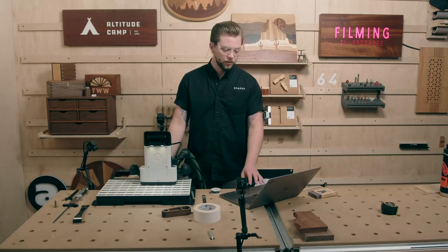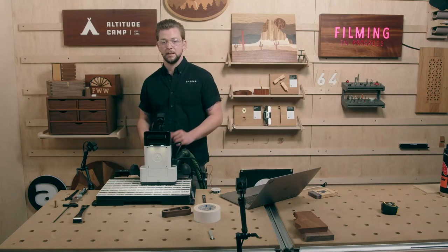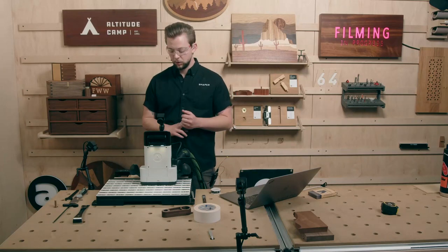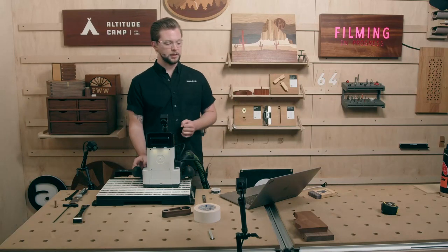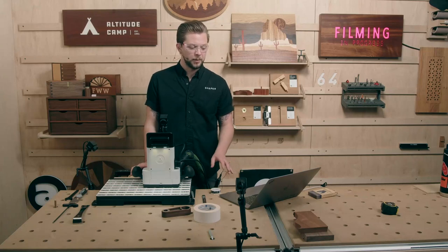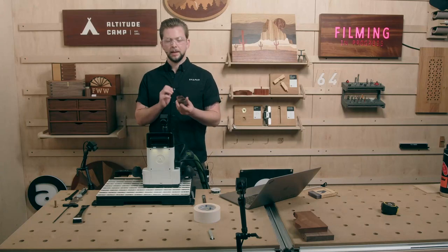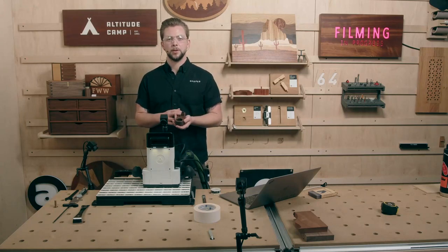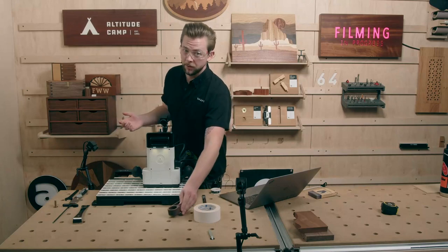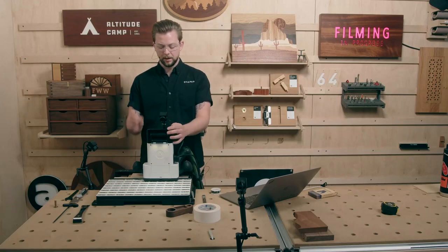All right, on to step number 11. We're going to take that same process that we just did, the pocket and the inside cut, to the center section, which is for matchsticks. I want to double check what depth they have us here. Okay, they say to a final depth of 0.32, and I think I might go a little deeper, just so I can fit a few more matchsticks. Again, beauty of this project is you can decide what you want to do. So I'm going to go down to half inch in two depth passes.